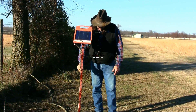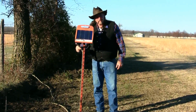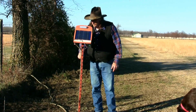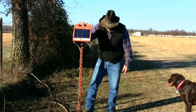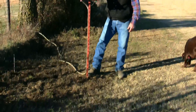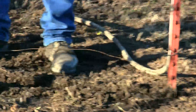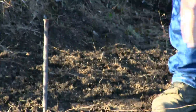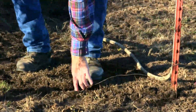You can see we have this wire spiraling down here - this is actually the ground wire. Here we have the positive wire encased in old garden hose, which I'll explain in a moment. We actually have two ground rods. There's one ground rod right here that I'm hitting with my feet - we'll zoom down so you can see how the ground wire is tied to it. Then we have this other ground rod about five feet away that's up a little higher, which lets people know it's buried.